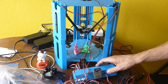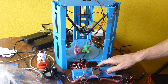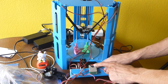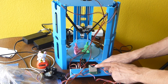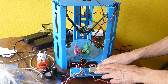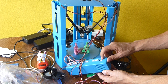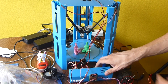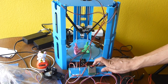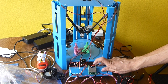The controller is pretty good — I haven't ever had any problems with it. It connects up to the machine. I highly recommend you do not print directly from the SD card, but instead get Repetier Host and print directly via USB from the computer. When you print from the SD card it's very unstable — sometimes it'll start, sometimes it won't — and you're going to have a hard time printing that way.